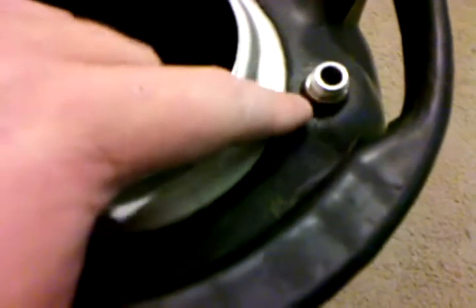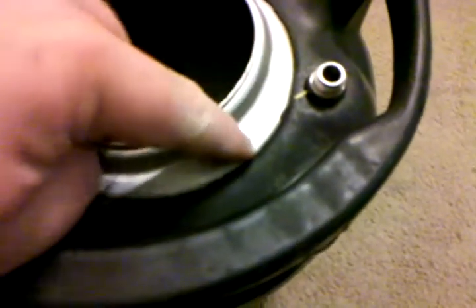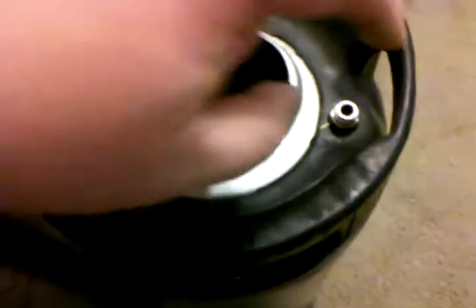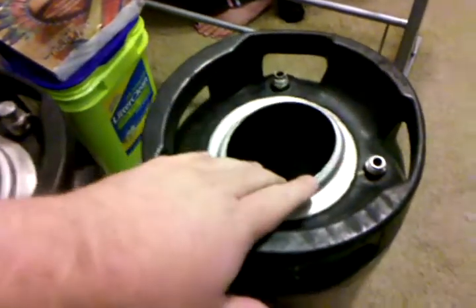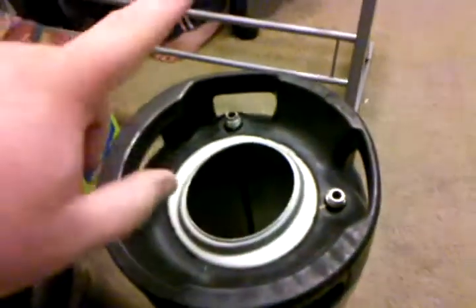When you attach the post, that puts pressure on that seal and maintains the liquid seal from outside to inside the post. The gas side actually has a very short tube — just long enough to put a seal on. This is the gas side, so there's no tube going all the way down. Normally the gas stays up here on top. The mechanics are: you put gas in on the top of the keg with liquid — beer, soda, or whatever — inside.